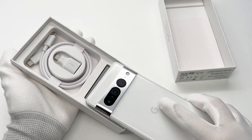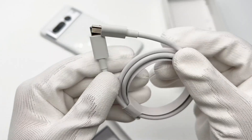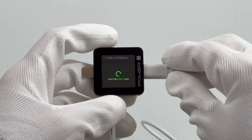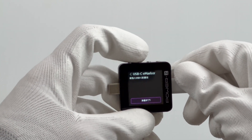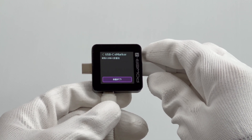Like Apple, there is no charger inside the box — just a dual USB-C cable and a USB-C to USB-A adapter. The ChargerLab Power Z KM002C shows it's not equipped with an e-marker chip, which means the current cannot exceed 3A. It also means you can use an ordinary third-party cable to replace it.